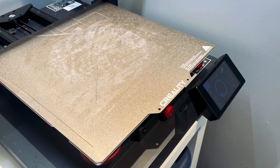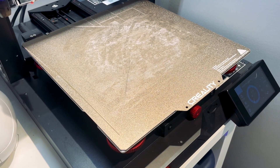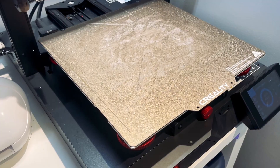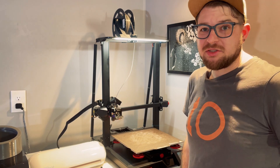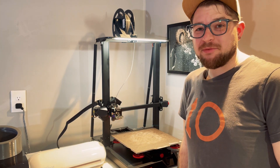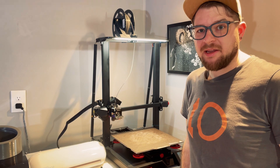One quick note about this print bed is that it does require a pretty even ambient temperature, which ideally would mean putting an enclosure around this printer, but it's just a little too big for that. If the ambient air temperature is a little too cold, your parts are going to warp and sometimes come right off the bed in the middle of a print. I tried printing with brims and glue, and that didn't really help — what really helped was just turning on a space heater nearby. It's expensive and not really ideal, but my prints are coming out great now.